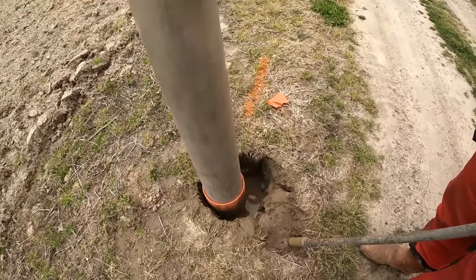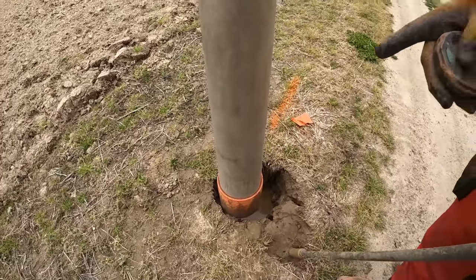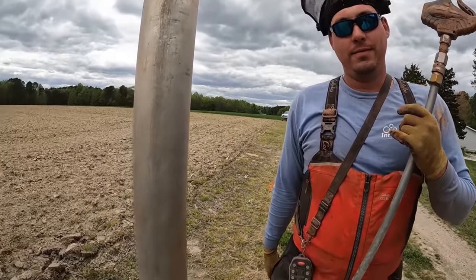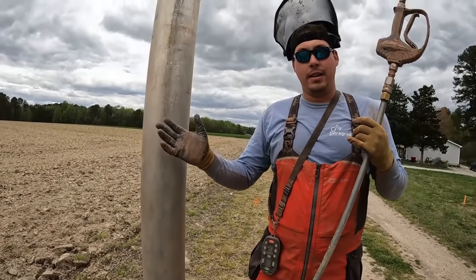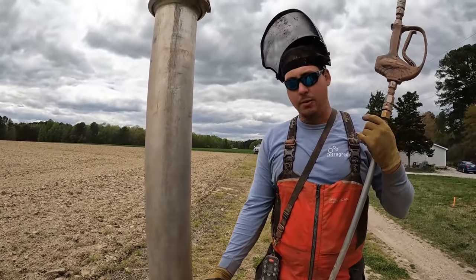Any business. Well, that was quick. That didn't take long. All right, pay me. This is why you do hydro excavation, people, because you can never trust a locate. That's supposed to be 24 inches. I know, that's what code is. What is that, 12? And see, you could have haphazardly just come out of here, you're 10 minutes from your house. Oh, I'll just go do this real quick. Next thing you know, that's a widowmaker right there.